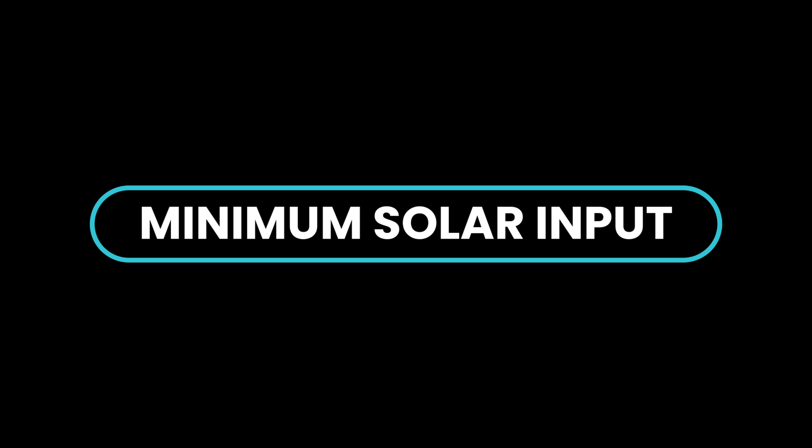On the solar charge side, I was talking about the minimum charge you can actually do on solar. I was annoyed that even on a really dull day you can't just pull in 10 watts, which would be enough to power my work laptop. The minimum amount of charge you can do via solar on this device is 20 watts — the device has to be pulling 20 watts via solar to actually switch into charge mode. However, I have noticed on the mini that it will still use solar power if it's available below that threshold.